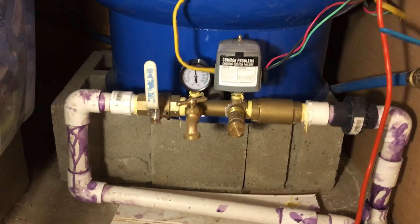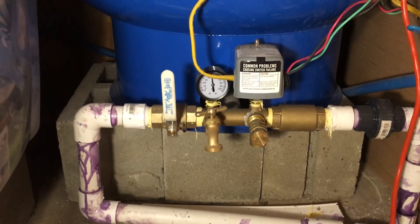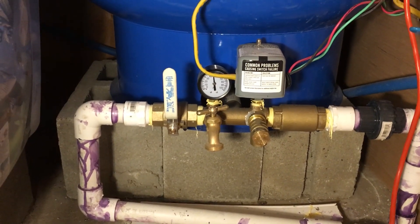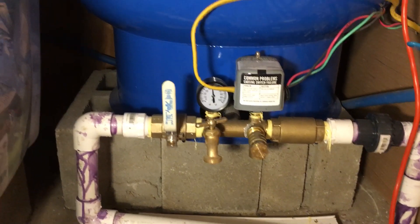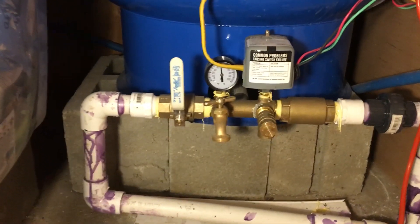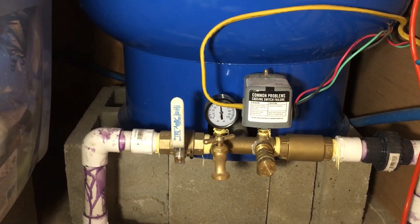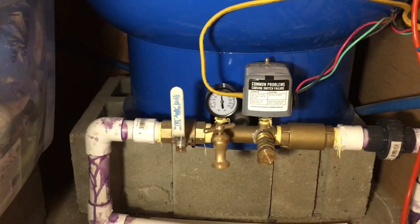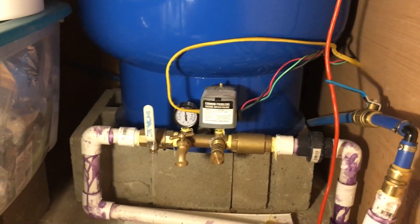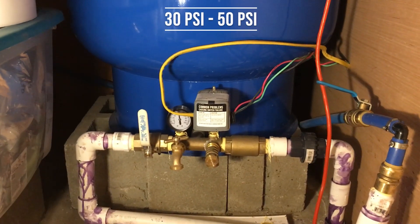For those who don't know pumps — and I didn't know any of this stuff, so I'm assuming somebody else wouldn't either — we have a well, and we have a submersible pump in the well. We have all these little relays and so on. When the pressure gets to 30 psi, the pump comes on, and when it gets to 50 psi, the pump goes off. That's all controlled by this relay.